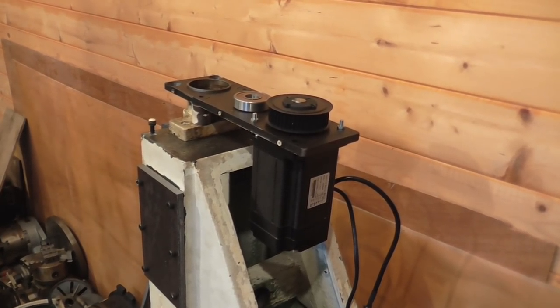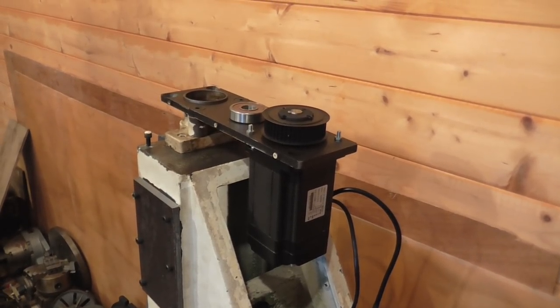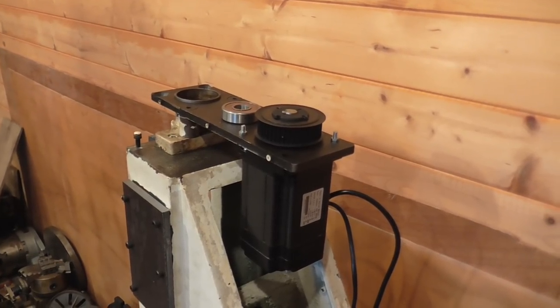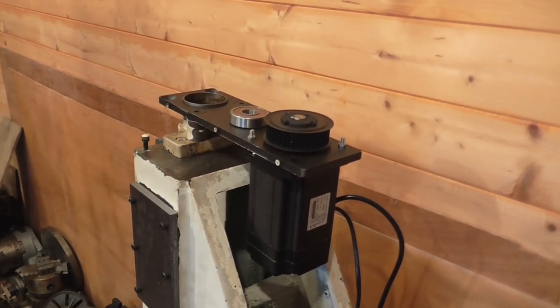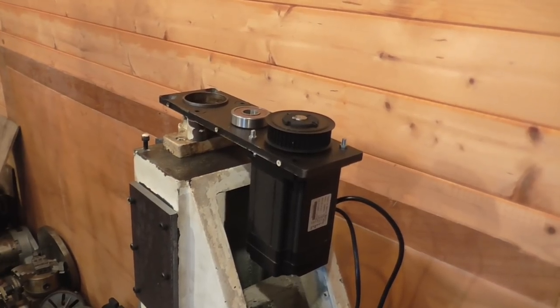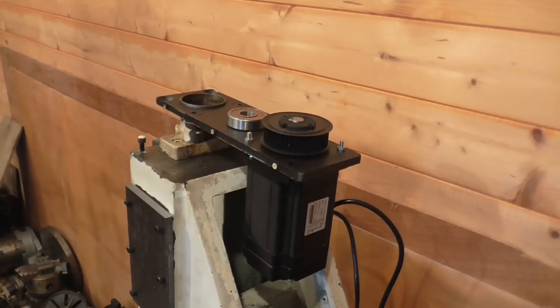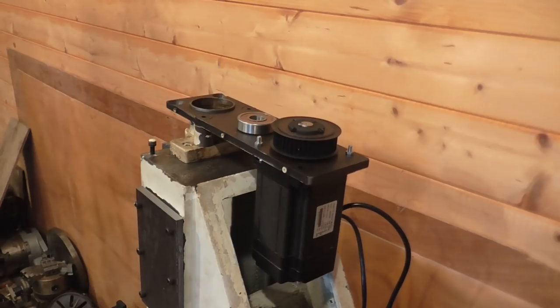Now, hopefully this is going to give me at least as much torque as the original motors, which ran a 1-to-2 reduction, whereas I'm going to run them 1-to-1, but give me higher speeds. If not, we'll come back down in the pulley diameter, sort it out.